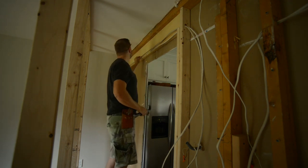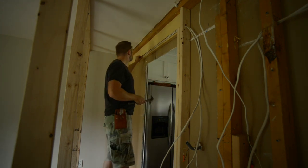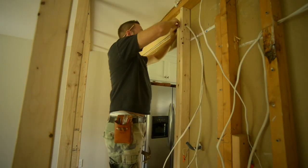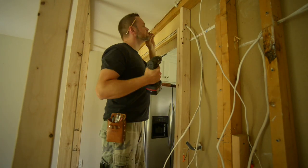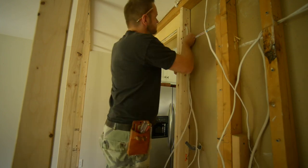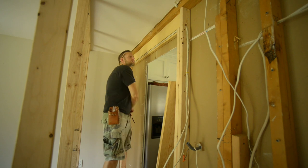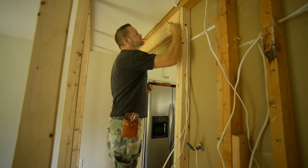Here I am tucking away all of the wiring - you can see I'm going to sandwich it in between the two 2x8s that make up the header. I already put in that half-inch plywood spacer, which is to build it out to make sure it's the same width as the wall. I'm just a normal homeowner, not a contractor, not an expert in any field. And if I can do this, you can do it. Bringing in my other half of the header, and I was measuring so I can make some marks on there to say 'hey, the wires are right here.' Caution - wires.